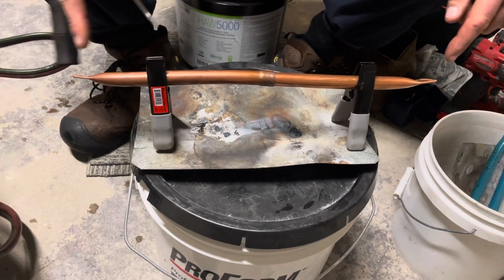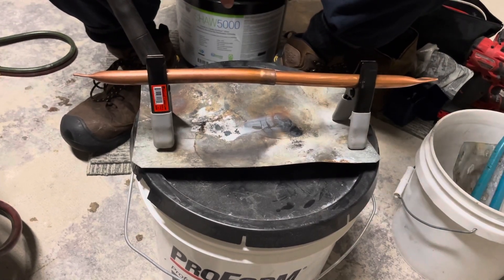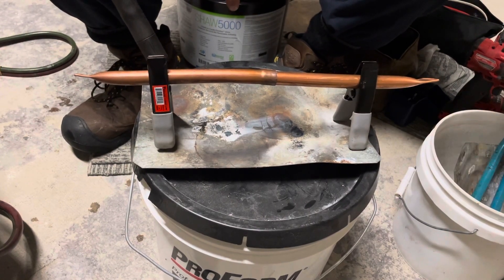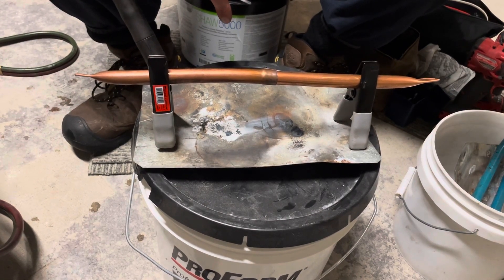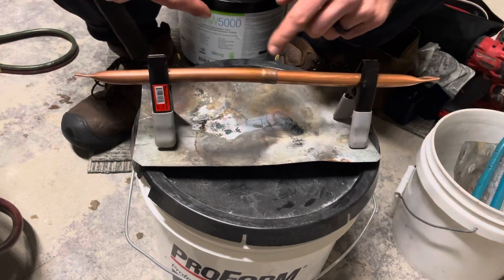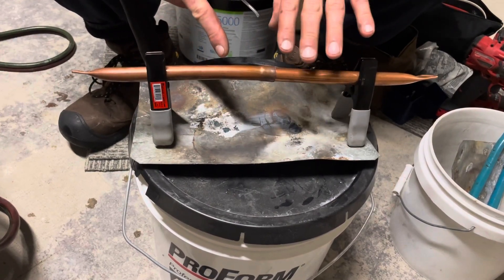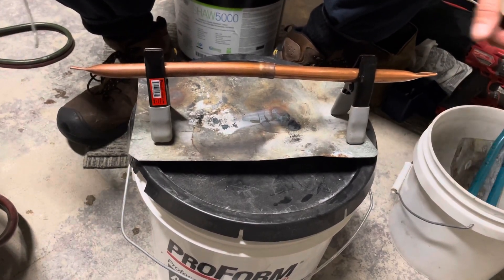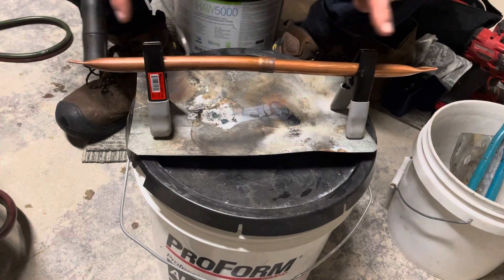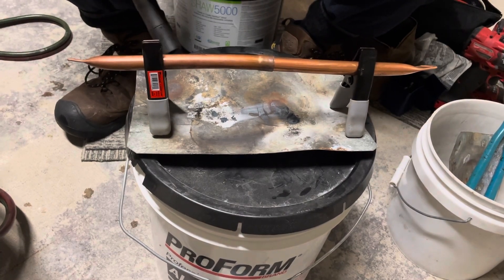I am making a few assumptions. I've got this crimped because when you see this demonstration done with both ends open, to me that's not realistic. You're getting a chimney effect and air just cycling through the pipe. I don't think that's realistic unless you're putting together stuff on a vice. If you're on a system that's had refrigerant in it, what you've got on one side is just refrigerant. You cut your pipe, a little refrigerant bleeds out, and then you may have a little bit of oxygen get in, but you aren't flushing oxygen through the entire system unless it's a brand new system. So my idea is just — if this is good enough to flush all the oxygen out of this joint, it would probably be good enough to work under realistic circumstances.